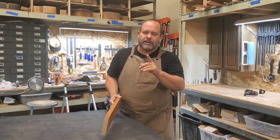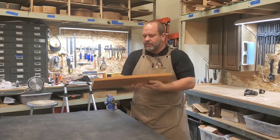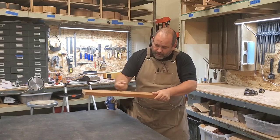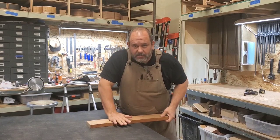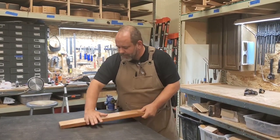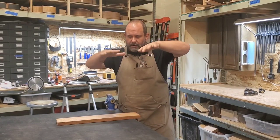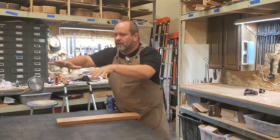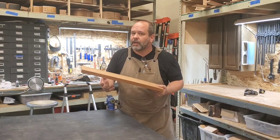Here's the reason why you can't do it with just a planer. If I have a board that has this bow to it and I put it through a planer, it's going to peel the top layer off. There are rollers pushing the board down and holding it as it goes through. Any flex or twist gets pushed down flat, peeled off, and it comes back out with the same exact bow — you're just going to have a clean bow. It's not going to do you any good.